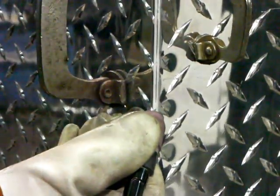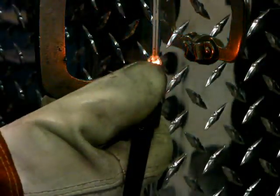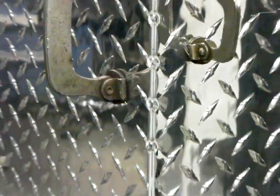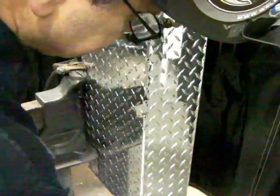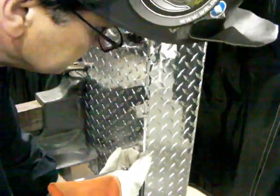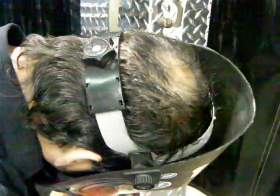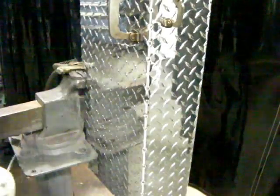Just tacking here — you may remember in another video we showed how to speed tack by propping the TIG cup real tight against the joint, making sure there's a good tight fit-up, even using the TIG cup to press pieces together, and then bumping the pedal real quickly. It's a good way to be productive, get something tacked together quickly. You can use just one hand while the other hand manipulates the pieces.